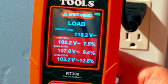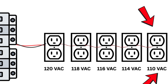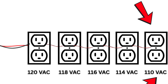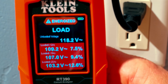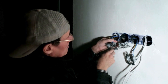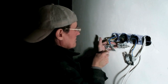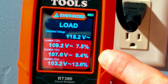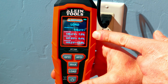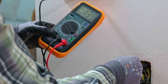I may have to look at this outlet. But keep in mind, the further you are away from your electrical service panel, the more your voltage will drop — because the copper between here and the circuit breaker panel is a pretty long distance, so it's going to have more resistance and more of a voltage drop. I prefer to not see all red like that, so I'm definitely going to open up this outlet and check for any loose wires, corrosion, or anything that might indicate my circuit is malfunctioning. But that just let me discover I may have an issue — I would have never known that without plugging in this RT390. You can discover circuit problems that you clearly would not be able to see with just a regular multimeter.